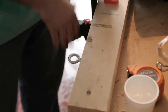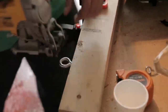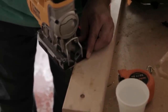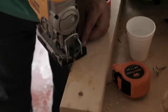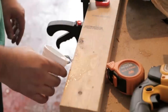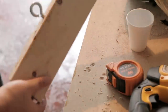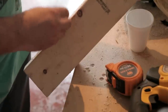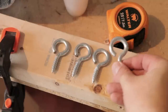After attaching the 2x4 to the work surface nice and securely, I used my jigsaw with a metal blade to cut a tiny notch out of the eye bolt. Make sure not to push too hard when cutting metal — just let the blade do the work. As it gets hot, cool it down with some water to save the life of the blade. When you finish, be careful because it will be hot — splash some water on it first. The size of the cutout only needs to be as wide as the hook for the pulley, just wide enough that it slides in and won't come off easily. Repeat the process for all four bolts.